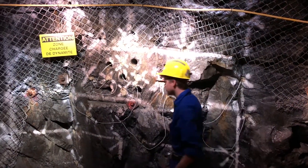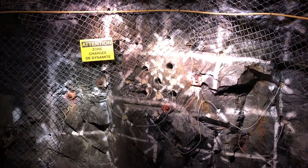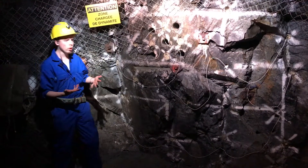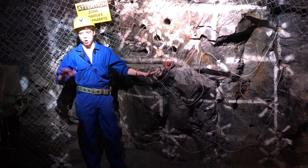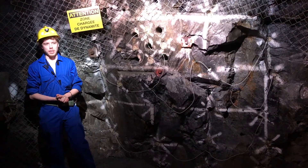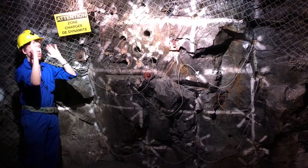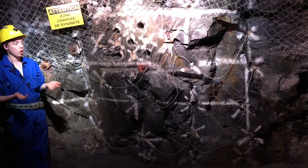Now we are going to be doing a blast on the underground tour. Before we do that, I'll go over some of the protocols. When you do a blast, you're obviously not going to be standing right in front of the blast area — that's simply not safe. We're going to be heading around the corner after I turn the lights on. I stay back here and light the fuse myself. Before I light the fuse I have to make sure everyone's safe, so I shout 'are we all clear?' Once everybody is safely in position just around the corner and ready for the blast, all you have to do is shout 'all clear' back at me, and then I'll know when I can light the fuse.